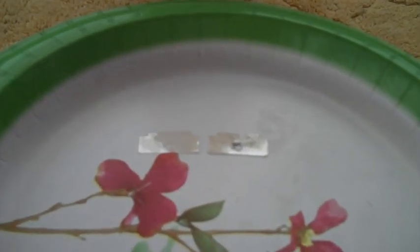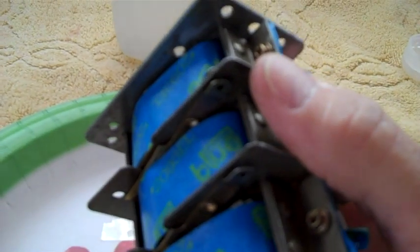Part of the restoration process with the tuner is you not only clean the tuner, but you should also clean the mica. The mica gets really scrungy over the years. I mean, it gets just as built up with crud as the rest of the tuner mechanism. But you have to be careful with mica. It's brittle. It's a mineral. It comes out of the ground. And they took this stuff and shaved it real thin.